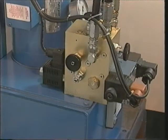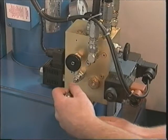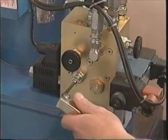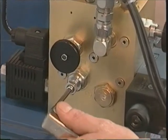The other valves on the manifold are used to control the operating speeds of the door. Although all of the valves have been preset at the factory, it might be necessary to adjust some of the valves to achieve optimum operation of the door. The final closing and opening speeds of the door, or cushioning speeds, are controlled by the F5 and F6 valves. Adjustments to these valves are normally made to make the door come to a slow and controlled stop.